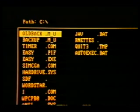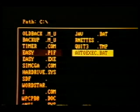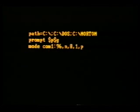When a PC is turned on, it automatically tests itself to check which features and options are present and to verify that the computer memory is functioning properly. It then loads the DOS system software, which searches for a file named AUTOEXEC.BAT. If this file is in the root or main directory of the startup disk, the commands in this file are each executed in sequence. These instructions set up the computer for the types of activities most used by the user. Often the last instruction calls a custom menu system or begins the most frequently used word processor or spreadsheet.